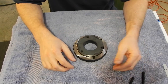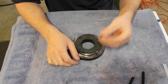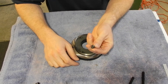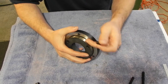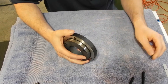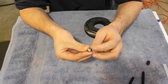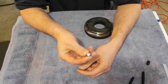The first modification I need to make is a personal preference. The set screws they gave you are hard cup-point set screws that register against this ground surface — that doesn't sit well with me. A precision ground surface and a cup-point set screw is not a good idea in my opinion. So the first thing I'm going to do is make these brass-tip set screws: I faced the end of the set screw, drilled it, made a little brass piece, and Loctite it in place.